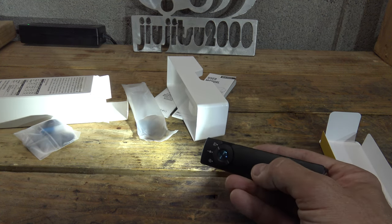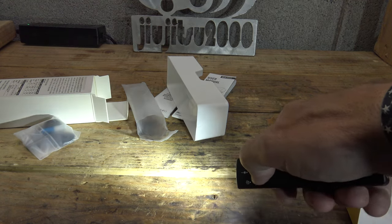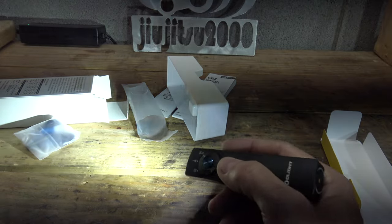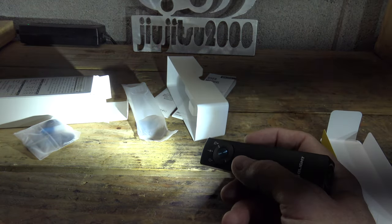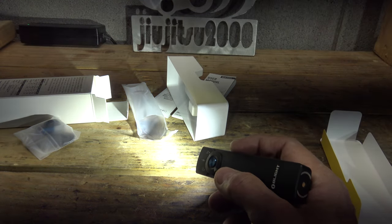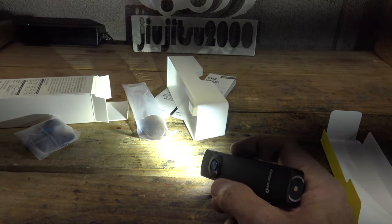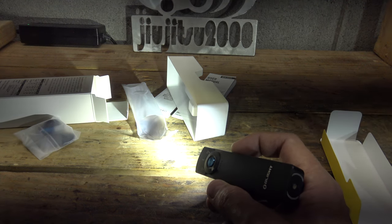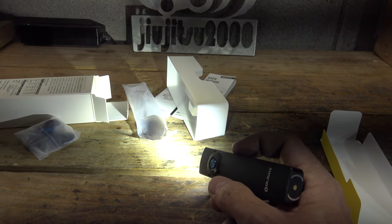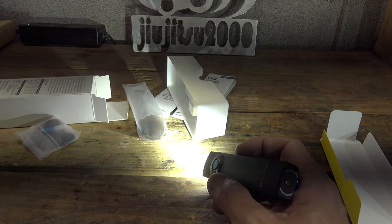I've already charged this light off camera. To get to turbo, double-press quickly — one, two — and now you have 1300 lumens. That lasts four minutes before stepping down, with 102 meters of throw and 2608 candela. After those four minutes of turbo, it steps down to high at 420 lumens and stays there for 126 minutes — 2.1 hours of runtime.